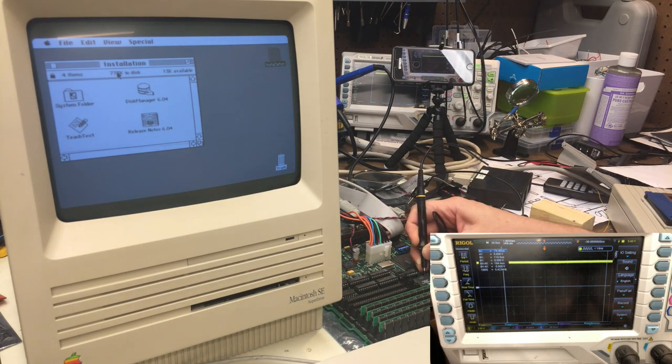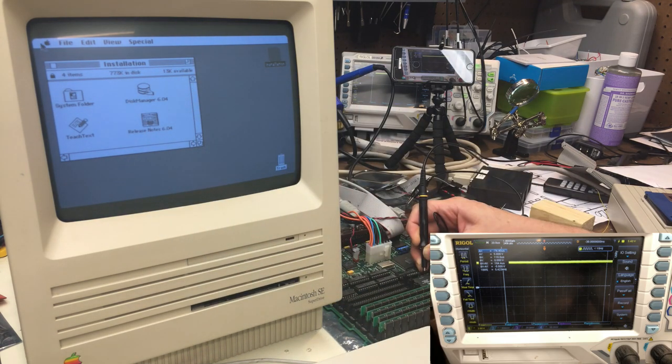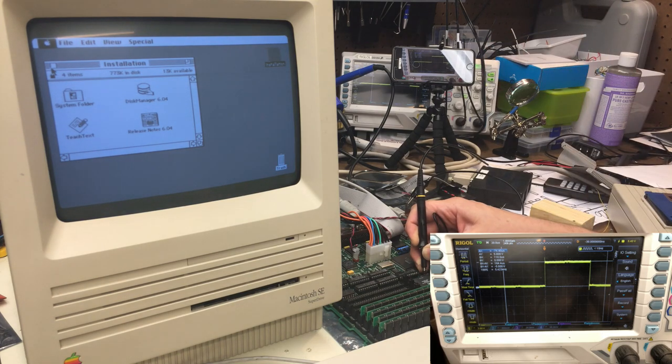As you can see, that line is high. But the moment over here that I launch something, like say the chooser, the machine is now frozen, and as you can see, it's trying to select the floating point unit. So either there are just some wacky traces between the floating point unit and the rest of the machine, or the FPU is bad, but I'm kind of stuck.